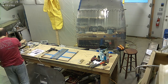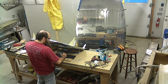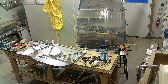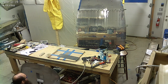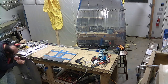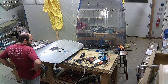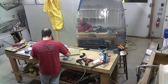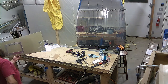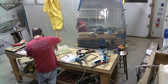You're seeing a big metal plate — I'm back-riveting those pieces now onto the firewall. You've seen me back-rivet with a big bucking bar, but you can also do it with a heavy metal plate like that. The trick here is you want to make sure it is tight against the firewall, and it's a little finicky because the flange on that firewall faces forward. We got most of it done, and Mary helped me with regular riveting for the rest of them.